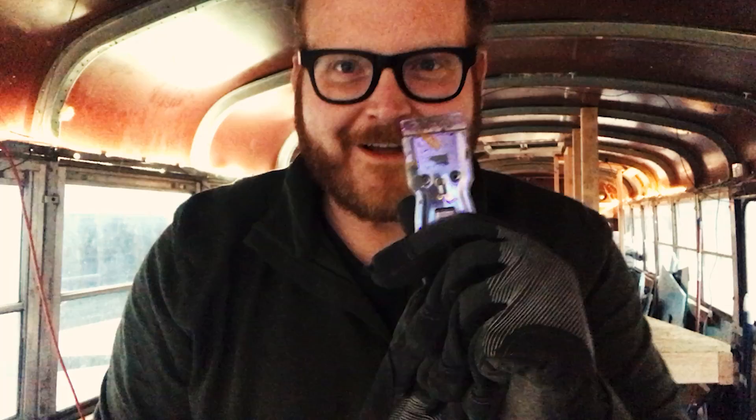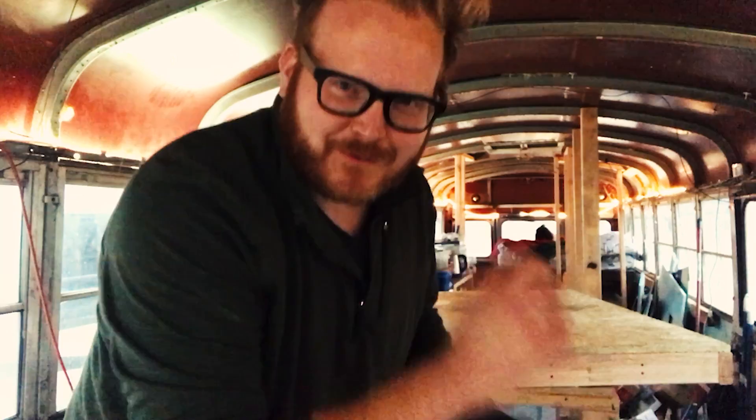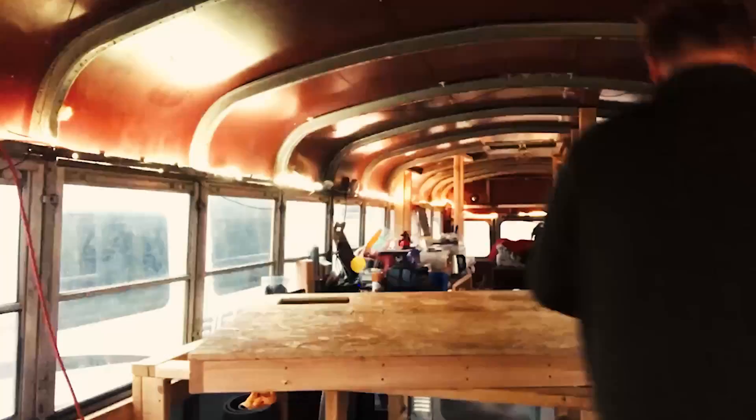The first thing I did was take this razor blade scraper and especially on these sides, because they're just 2x4s, I really roughed them up and scored them. I put big scores into the wood. We really want that concrete to have something to grab a hold of. So I'm also going to sand the top, but I wanted to start with that. Let's do it.